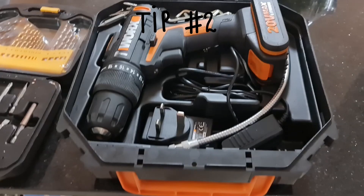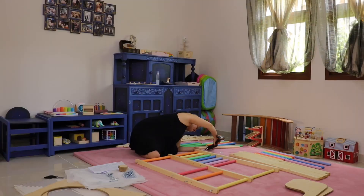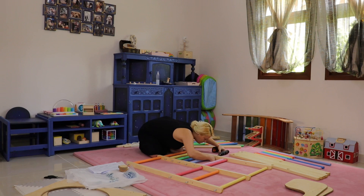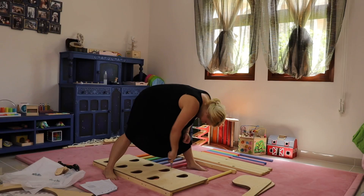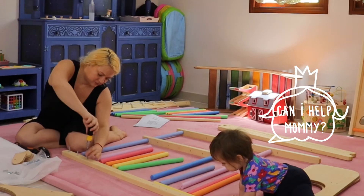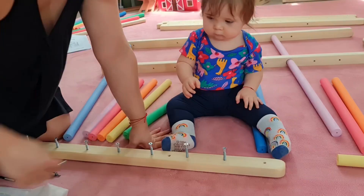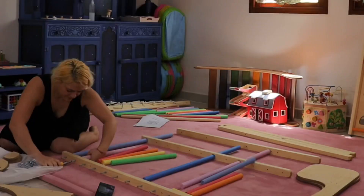But if by any chance you have a power tool or another tool with an integrated hex, use that — you're going to save your nerves and a lot of time. The classical hex is way too easy to drop. Do not overdo it with the power tool though, as you may damage the wood. Put it on a setting that will skip easily the moment it starts to get harder, then do the rest by hand at a very low rotation speed.